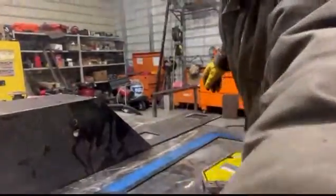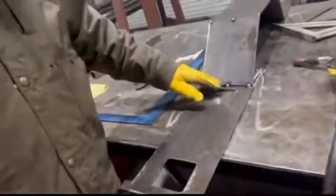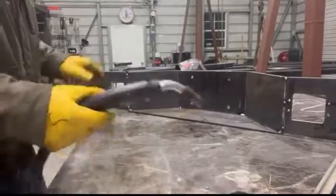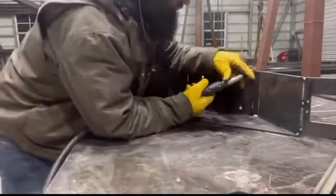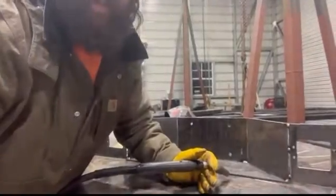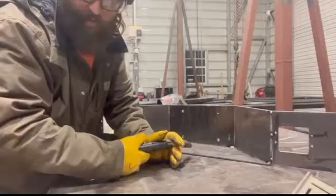So now what we have is the license plate, trailer plug is going to go here, and then the 2 light pods. And we're gonna go ahead and weld out the middle, and we're gonna bolt it up and get some measurements going again. So I'm just gonna go ahead and weld this thing up. I do a lot of downhill MIG welding around here. Some people say that's not the best, but I've done a lot of it, never had any failures. So I run it.